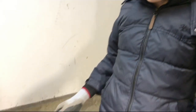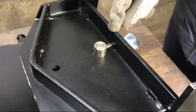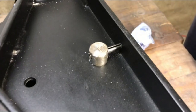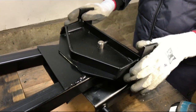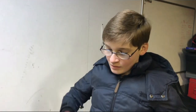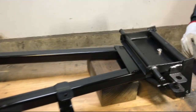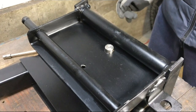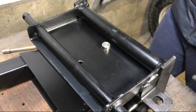We've turned the frame upside down now and knocked the roll pin through so it goes through this part of the swivel bracket and through the pin, so that when we swivel the bracket, this part moves and not the pin. We've turned the frame back over to the right way up, and the only thing left to do now is to put the grease nipple back in the top of this pin, because we took it out to tap the pin through.